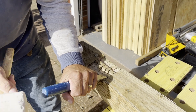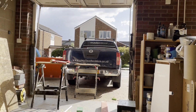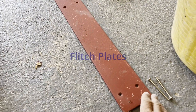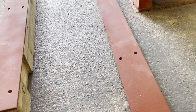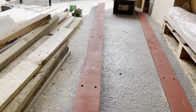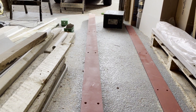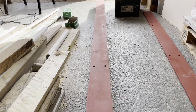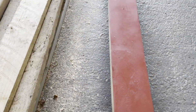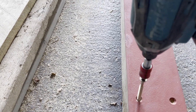I've just put a little recess in this post — a slot — so it's going to slot into the top of the post about 15mm. It'll just keep it nicely in place. We're getting some quite heavy showers at the moment. These metal plates are 6mm thick and I'm screwing them to the side of my timber posts. That's going to prevent the posts from twisting. These are my top rails, which is what the roof is going to roll out onto, so I obviously want that to stay square. I'm going to pre-drill the holes — these are 6x80 screws, so they should do the job nicely.